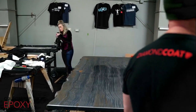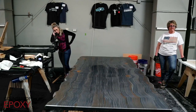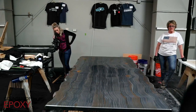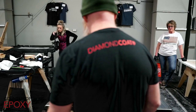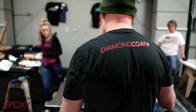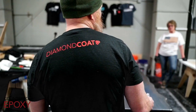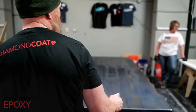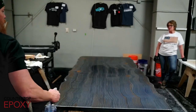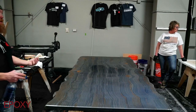little sharp veins. He's saying that with that wood grain, what you're really trying to do is incorporate that color into your base. So every time you scrape, you're just moving that gold in there, and then now we're going to spray a different accent color, and we're going to scrape and get that blue underneath that top layer, and then tomorrow when we sand it, it's going to uncover all that and be just beautiful.